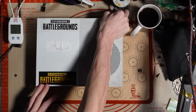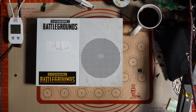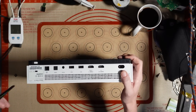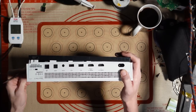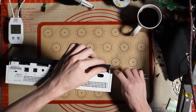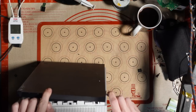Alright, so it's a beep on, beep off. That's a fun one. What's step number one, come on. Let the case off. Yeah, you've got to open it, check the ports. Well, you guys are in control. Check the ports, visual inspection of the ports. Get the biggest flat blade screwdriver you can and prise it open. No, we're going to do it properly. See if there's any fluid damage. If not, pour a load of soda in it.